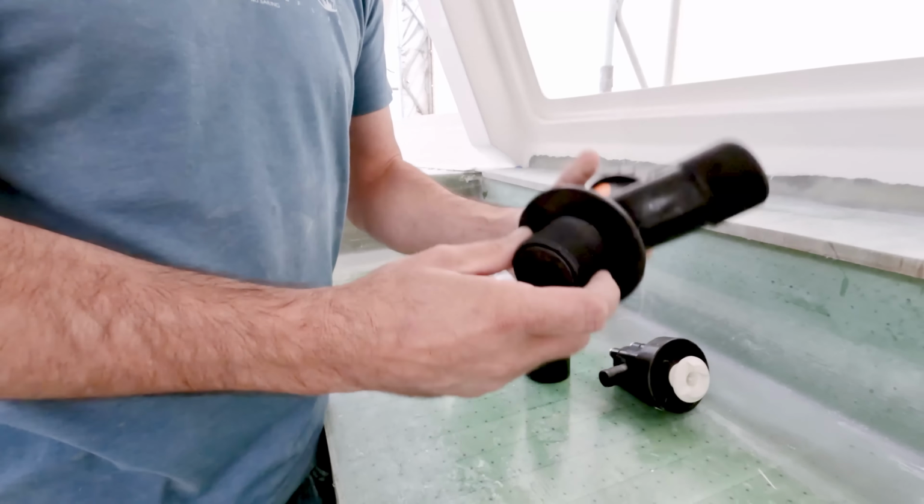And there's a new hole in the boat. Nice thing about having a brand new hole saw, it actually cut through really well. So now I need to decore that area so again the water can't get in there, and then clean up this surface so I can glass it, and that is going to get bonded right into there.